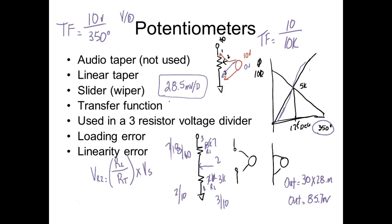When they calibrate your meter, they calibrate it according to a standard, and that standard is going to be a heck of a lot more accurate than what you're measuring. The best we have on meters are what we call 4.5-digit meters. If it's a 4,000 count meter, we call it a half a digit, even though it's not true. Your most significant digit on no meter will ever actually go from 0 to 10. It's going to range on a digital meter depending on the resolution. We have 3 basic resolutions: 2,000 count meters, 4,000 count meters, and 6,000 count meters. The 6,000 count digital meter has the best resolution, but still the most significant digit is going to go from 0 to 5, and then 5.999 if it's a 4.5 digit meter.